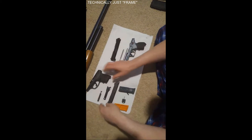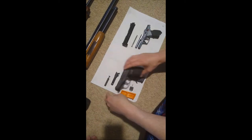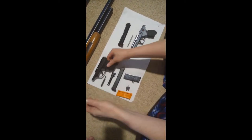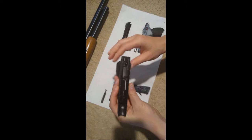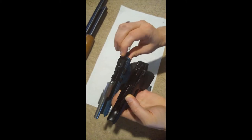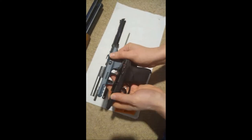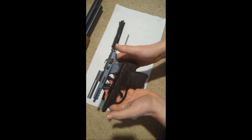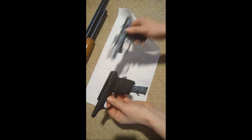Some others may use that design. Oftentimes, especially when you start talking about carry handguns, you're going to have a separation of your frame from the rest of the gun. On this striker-fired gun, you don't have some of the other assemblies like on the SR-22 here. We've got our hammer group here, but both of them have whatever trigger linkage and assemblies, sears, springs, all kinds of fun little moving pieces. Both of these have safeties that are built in. Some firearms won't have a separate safety — like Glocks — the safety is just built into the overall design of the handgun.